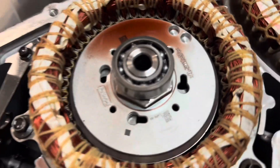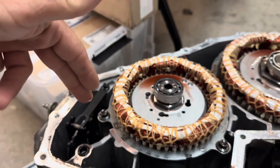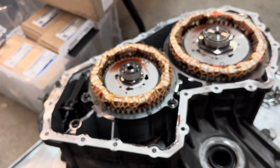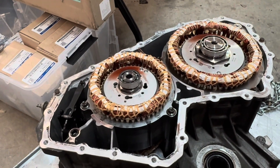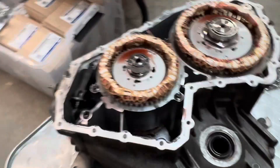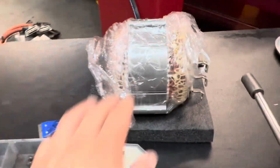The nipple is actually down in there — you can kind of see it, we'll pull it out. What happens is the magnet grinds into the windings and it comes to a halt. The car doesn't move, it doesn't run — you get the red wrench and all that. So we are going to replace the stator. Here's the new stator.